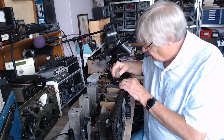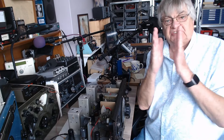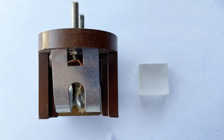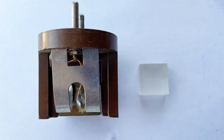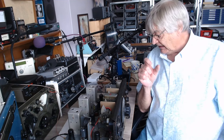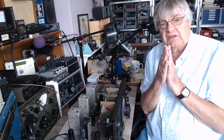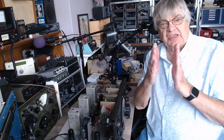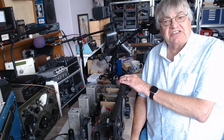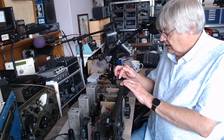The crystal itself inside, between two brass plates, was just wobbling about in there. With a bit of adjustment — I won't say bending, but that's what it was — I've got the plates against the crystal. The crystal is almost a quarter of an inch thick. The reason is the thinner the wafer of quartz, the higher the frequency it vibrates at; the lower the frequency, the thicker it needs to be. So it looks like an ice block in there — 465 kilohertz.